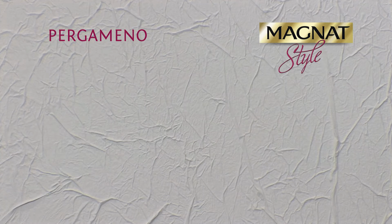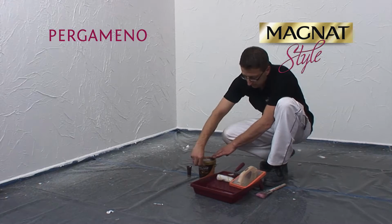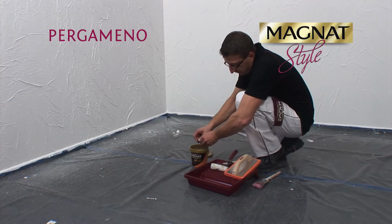Surface coloring. Coat the finished texture with the pigmented MAGNAT Style rustic top coat sealer to produce the decorative effect in the color of choice. Add enough MAGNAT Style coloring pigment to the clear top coat and mix the products thoroughly.